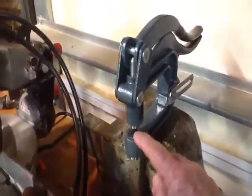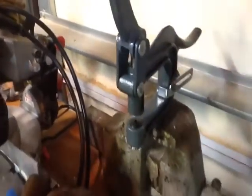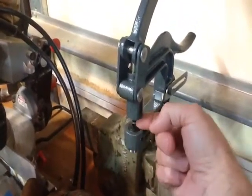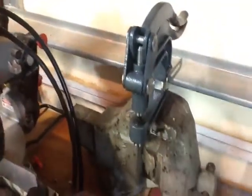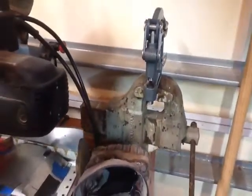Over here, I've showed this before, but let me show it again. This is a little hole punch. You can adjust the dies and the anvils in there, and you clamp it in your bench or any kind of a vise, and then there's a little dot there on the bottom, and you find the hole and just make the neat, clean 1/2 inch brass hole like y'all saw a minute ago. So those are the tools, and that's the update from the shop tonight.